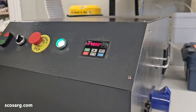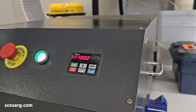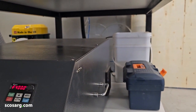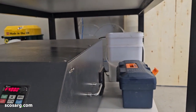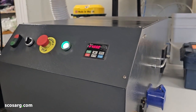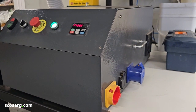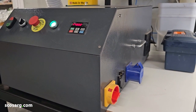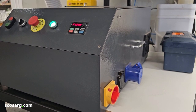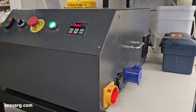You've got your inverter display which shows the frequency in hertz, and the on and off button for everything including the water cooled pump, which is for the water cooling spindle. You can also opt for an air cooled spindle with this machine. You've got the on and off switch for the vacuum pump, your emergency stop, and then down on the side you have your main isolator, a socket so you can plug your vacuum pump in, and a socket for your water pump as well.